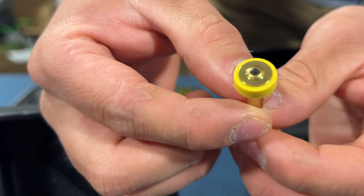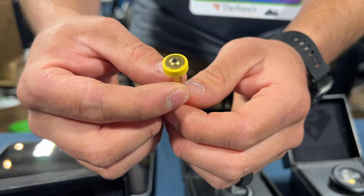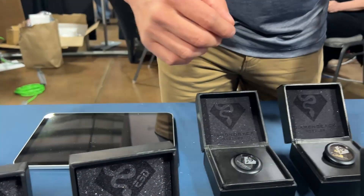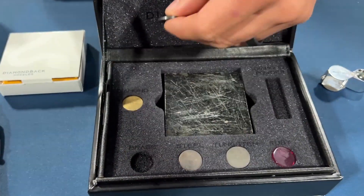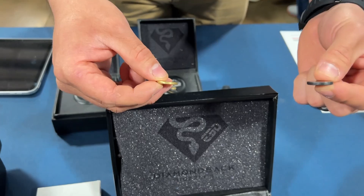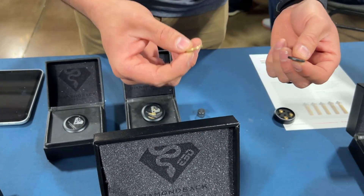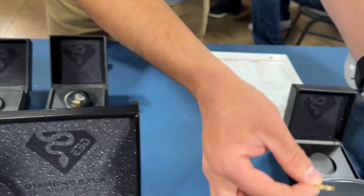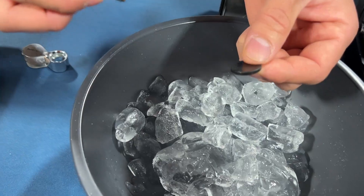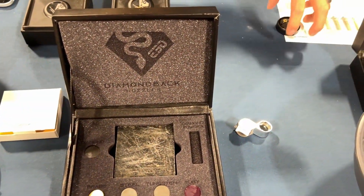The diamond-tip nozzle — here's a diamond-tip Revo — gives you benefits of abrasion resistance, great thermal conductivity, and low coefficient of friction. To demonstrate, we touch a piece of ice: the thermal conductivity of diamond versus brass is about five times as much, so the diamond actually melts the ice a lot faster. You can feel the difference, even if it's hard to see on camera.